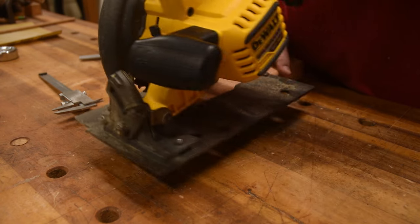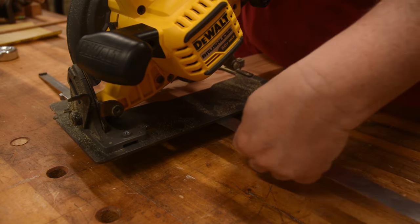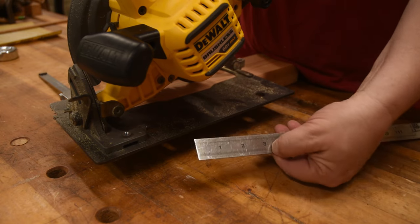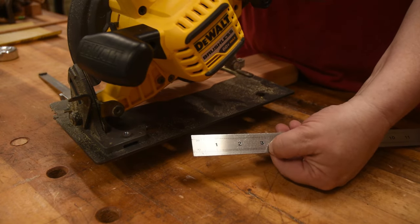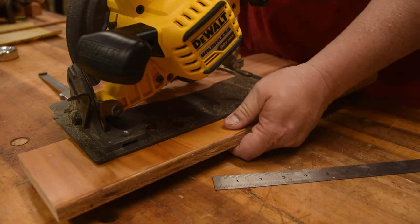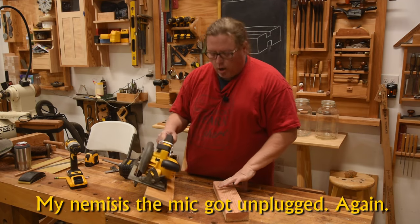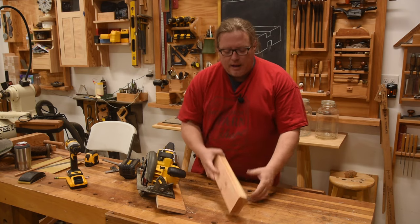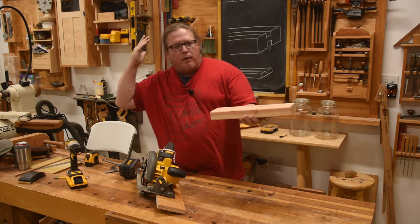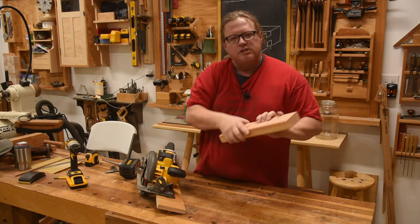So what I want to do is take a measurement from this blade right here, which is 3 1/4 inches, which means that's where I want to place my fence when I screw it down. So with the fence now securely screwed in place, all I really need to do now is figure out how I can secure those long 2x4s so I can rip them along the sides, rotate them, and rip them along the other side to make that